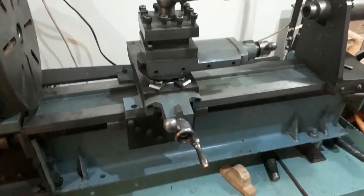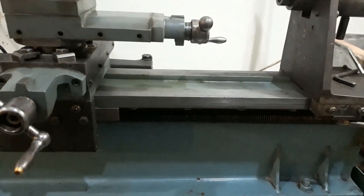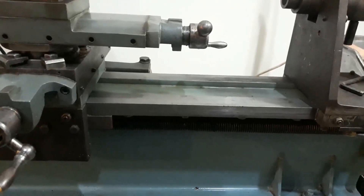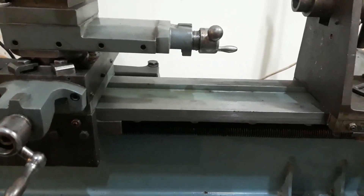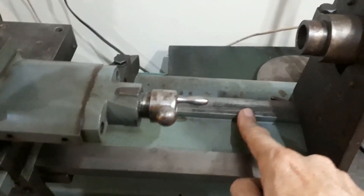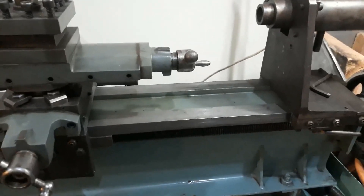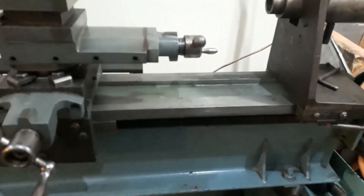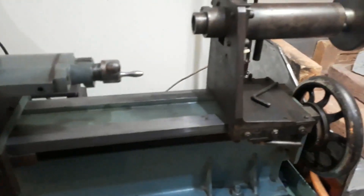You're probably wondering how I made a bed from scratch by hand. I had access to steel stockists but no bright mild steel section, so I had to use what we might call black bar hot rolled, which was very imperfect in dimension with a very poor surface finish — you can see a little bit of that poor surface finish left there. The way I did this was by filing the ways flat, straight, and square.